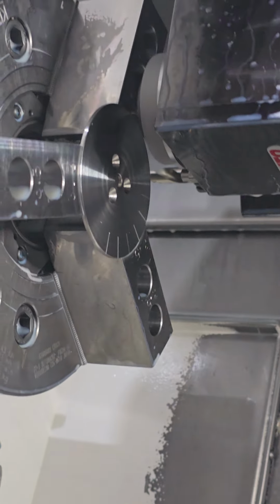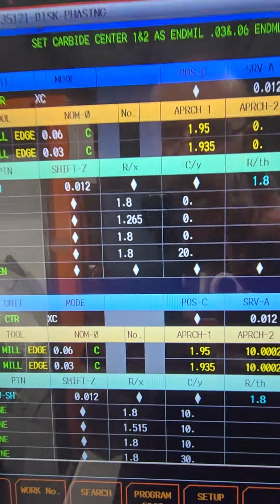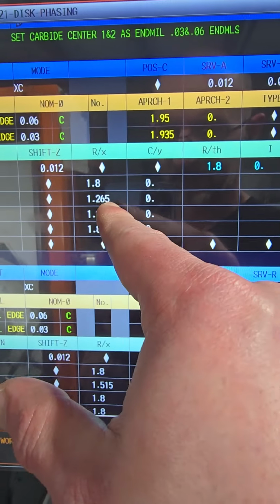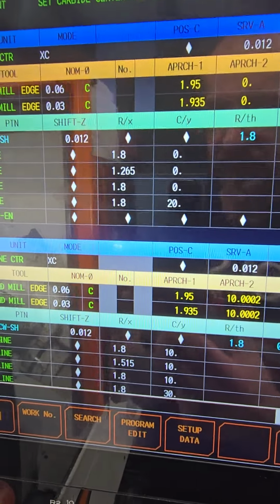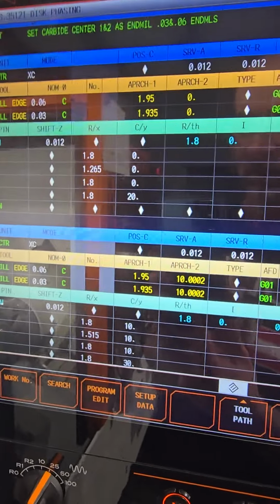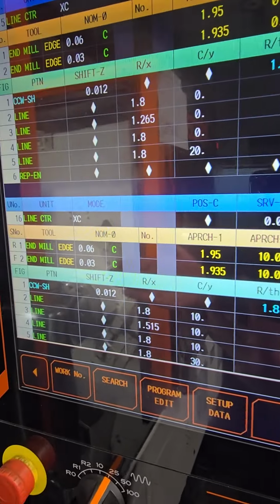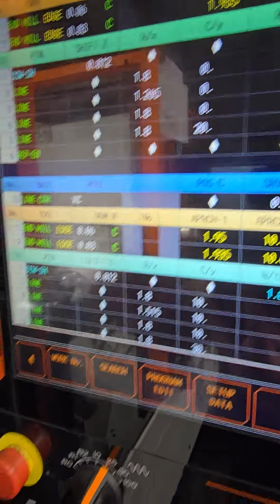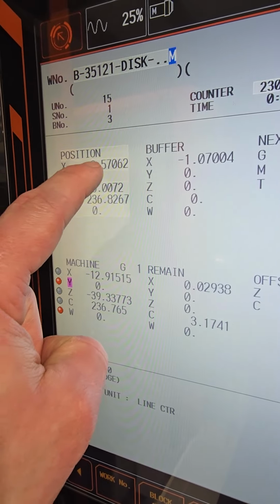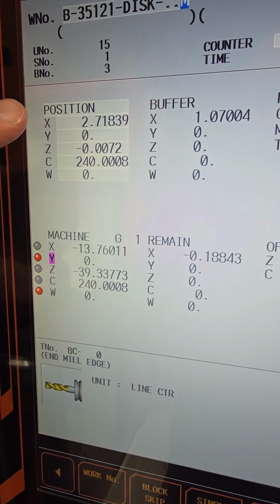Now, one thing to consider with these is that if you set it to 1.265, from what I remember, the tool was actually coming down a little bit lower, because the machine does some compensation. So I ran my first lines, and I changed the Z offset a little bit, like 1 inch from the part. I followed the position, and let's say I needed to go to 3 inches, and it went to 2 inches and 900.